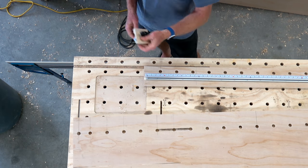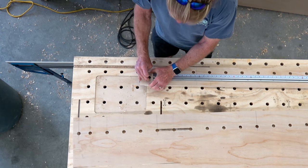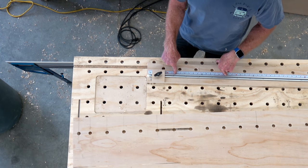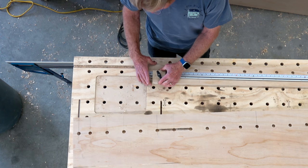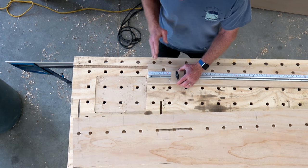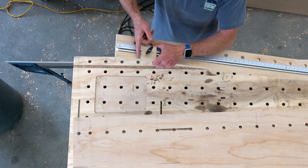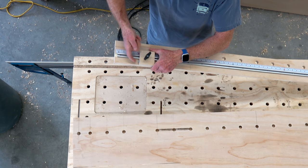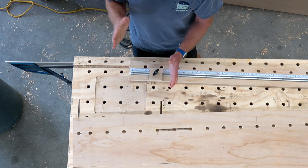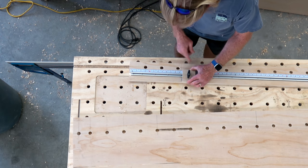The stop block is just a simple block with a dado in it, and that will fit right into the T-track. I can read right off the tape measure I put on here — a tape measure that's both metric and imperial — so I can just slide this along and read right off the body. Because stops need to be adjustable, I put a screw in, pre-drilled, and set it up far enough out that I could screw it in or out to move it just a little bit and really dial in the stop. It's a simple block with a screw in it. I just move it along and set it right on what I want to cut.